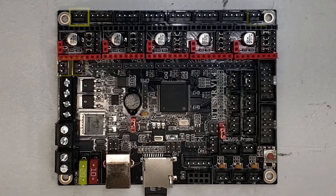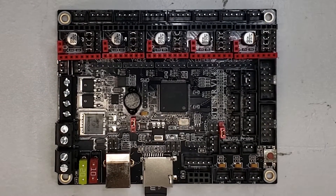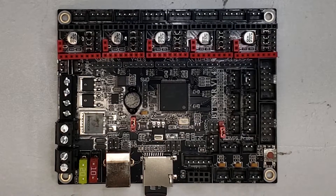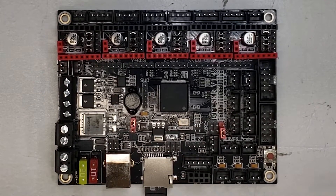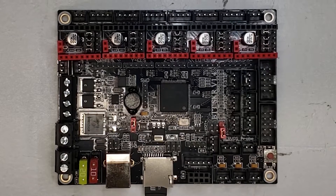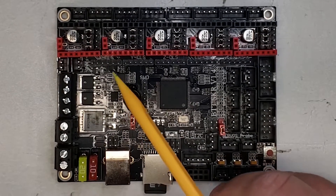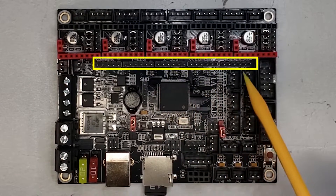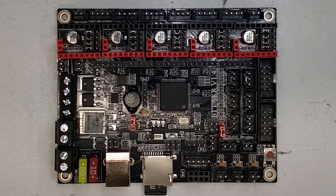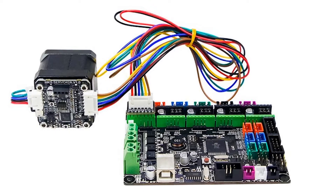Most people might say they don't necessarily need four different fan pins, but the nice thing about having multiple controllable fan pins is that you can turn your fans off when the printer isn't directly printing or running. This is great when you have something like TMC 2208 drivers — no need to blow air across these if you're not actually printing. Something else new is that there are dedicated pins for closed loop steppers, which work differently than traditional steppers and have the ability to detect missteps and know more precisely where the print head is.